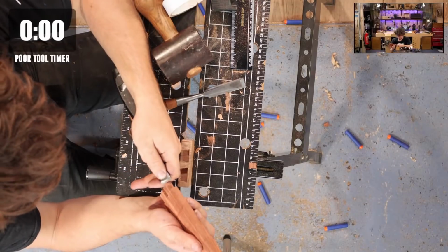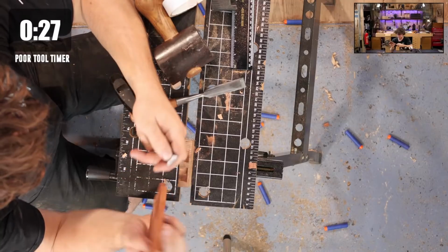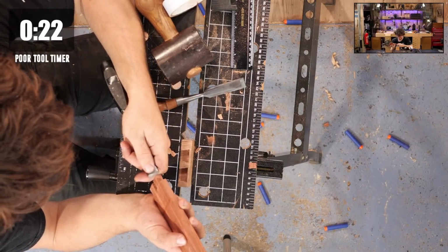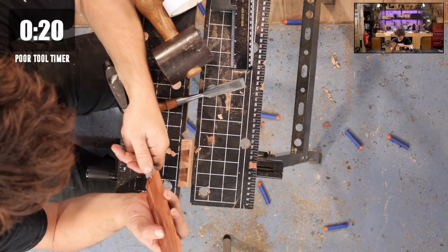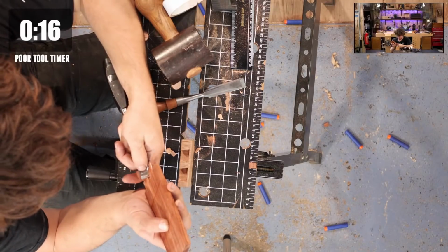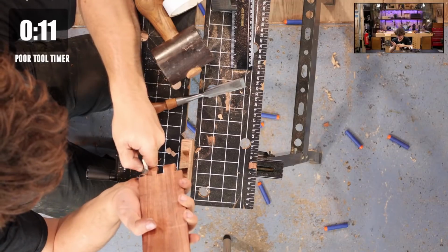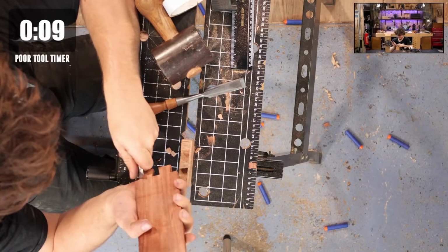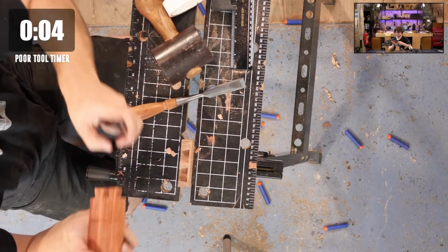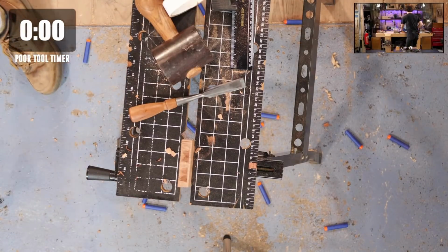So obviously when I'm doing this, I'm choking up on the chisel. So even if I was to get shot in the face, I shouldn't slip, and I'm making sure I'm doing it on the back. Oh, that's starting to go in. I'm so excited. So just chamfer in the back, and that apparently helps glue spread in the joint and also bridges over any gunk that's in the bottom corners of that socket, stopping the joint from bottoming out. Chip that away. I think we're going for it. I think this is it.